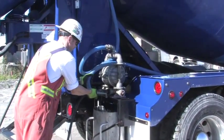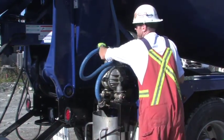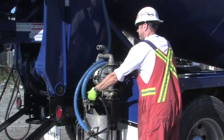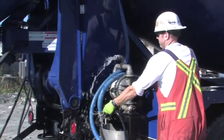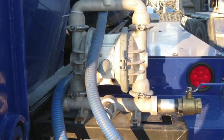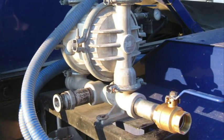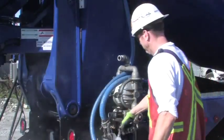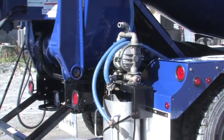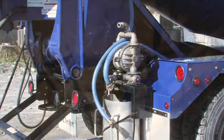To prevent the system from icing up in winter conditions, all you need to do is unhook top and bottom cam locks from the pump, open the drain valve on the inlet housing, then turn on the pump for a few seconds to drain the water from the pump. Enviroguard pumps are also customizable to be fitted with release ball valves to keep the system free of any water that may cause freezing. In severe cold weather, you may need to spray hot water from your nozzle onto the pump to loosen any residual water that makes the balls stick on the inside of the pump.